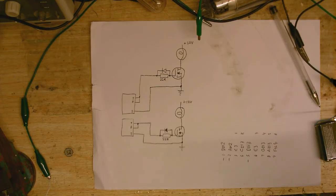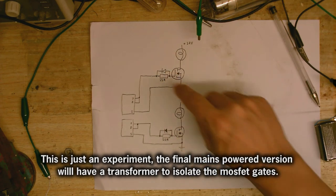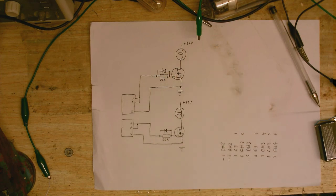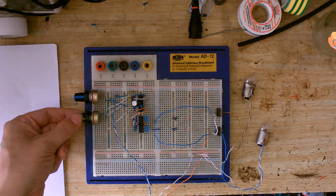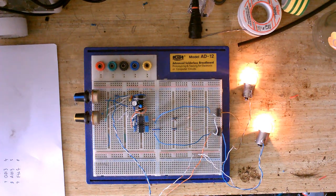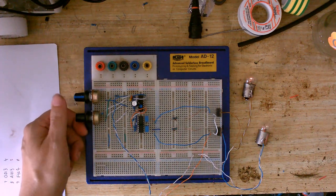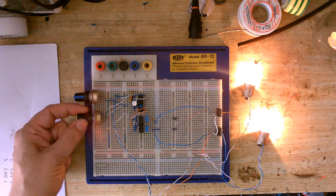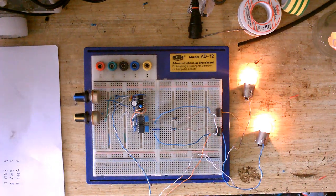What I want to try here is the MOSFETs connected directly to the gate driver chips through a 22-ohm resistor and a diode. These diodes will make sure that the gates discharge nice and quickly. I've also decided to use a couple of light bulbs as the load, so when I turn this on the bulbs should come on a little bit, and as I adjust the duty cycle they should get brighter and dimmer. And okay, the bulbs have come on — let's adjust our duty cycle. Going really high — of course they're not going to be as bright as before because now they're only getting about 50% duty cycle at the most. Let's turn that off.